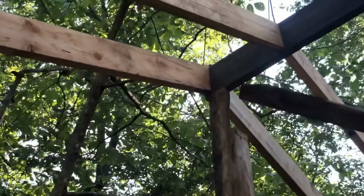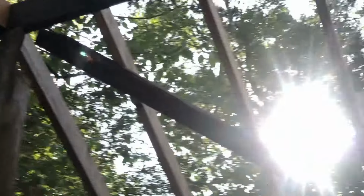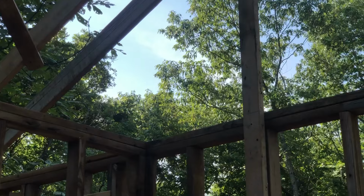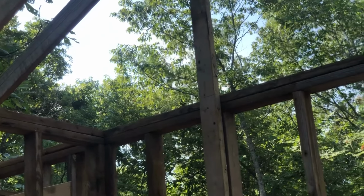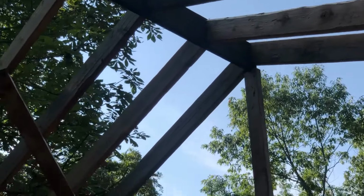I took them off and I made a little beam pocket, is what you call it, and I put 2x4s on each side so I could lay it up. You probably saw in the footage, but I put one of my rafters on flat, kind of triangulating that, crossing it so I'd have a place to set the beam. These are just kind of little things you do if you're by yourself, but super excited.